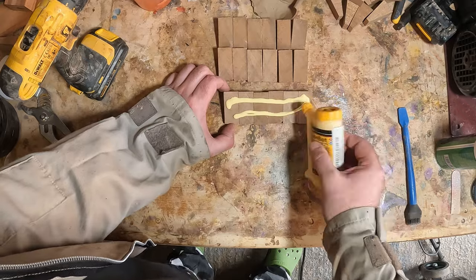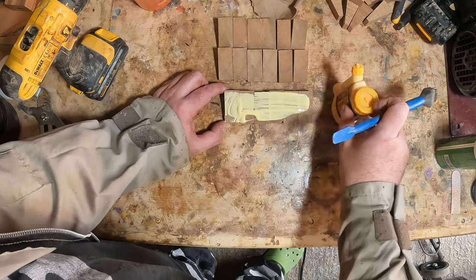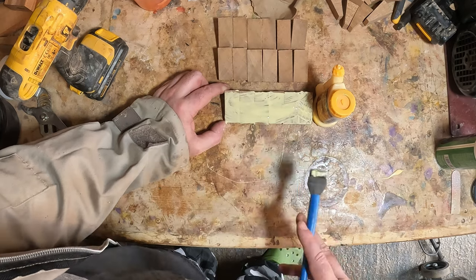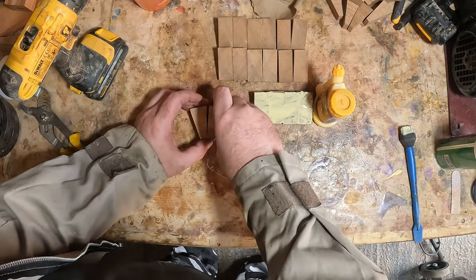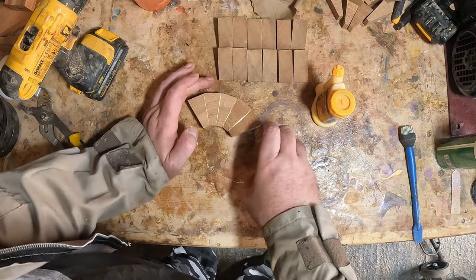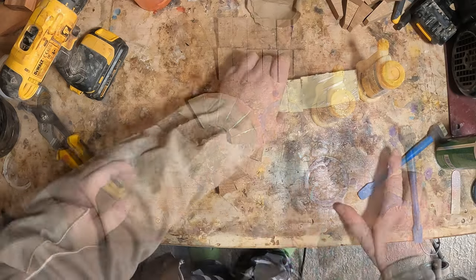Next were the four segmented rings for the upper section. These were solid — as in no resin joints — so they were easy to do. I applied Titebond II to one side of each segment, then loosely assembled the ring and used a hose clamp to hold it all together and squeeze the joints.